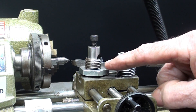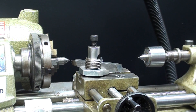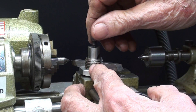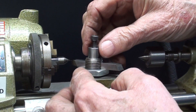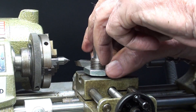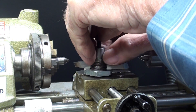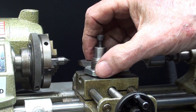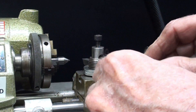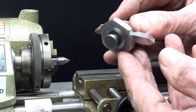Here's the prototype. I made it just a little bit shorter and it fits up so nicely. The whole idea is — this is your tool post wrench — if I loosen up the main tool post tightening screw, I can raise and lower the tool simply by turning the nut until I get it right on center. It just works very, very well. There's supposed to be a little gap right underneath here — that's the way it's supposed to be.